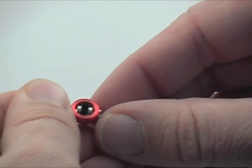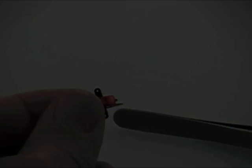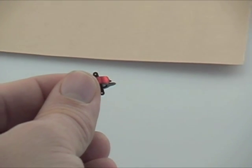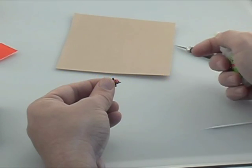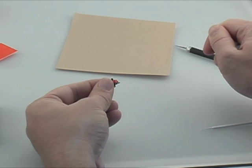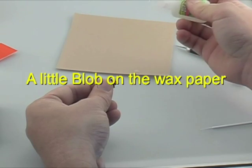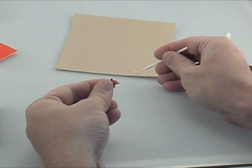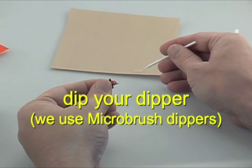You can see how easy it is to put it on the outside. The position is not that critical really, but once you have the position you want, glue it with some medium CA glue — do not use thin CA glue for this procedure. We want to use medium or thick CA glue to prevent the glue from wicking into the works of the actuator.